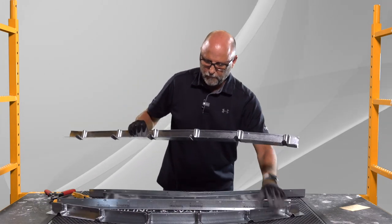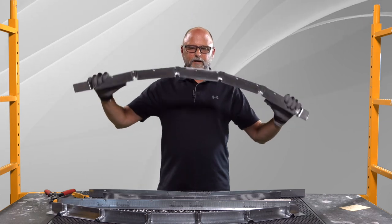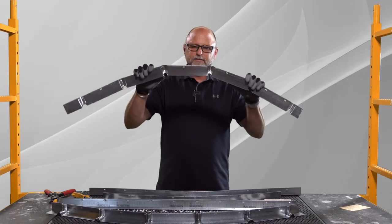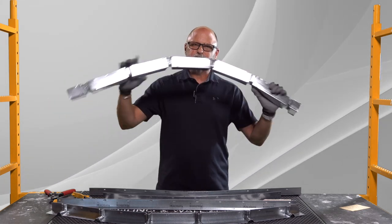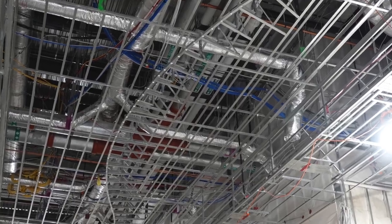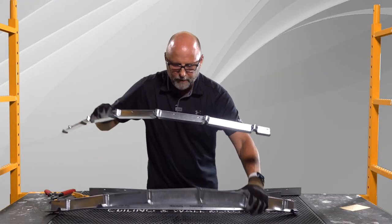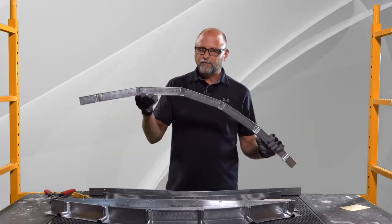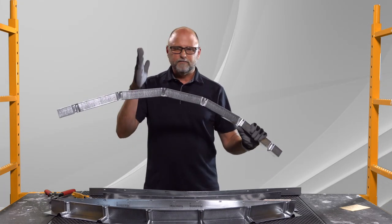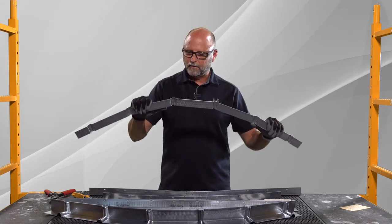Conversely, we have the two inch by two inch in a 25 gauge product. This bends easier, but not nearly as easy as the 20 EQ did — it still has very nice memory. You're going to have your framing come perpendicular into this on 16-inch or 24-inch centers. But if you're framing a project with initial framing at four feet on center, the 20 EQ CAM is a very nice product to use because of the rigidity it has after it has been curved.